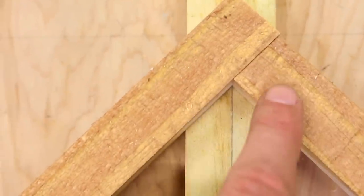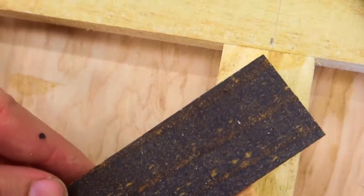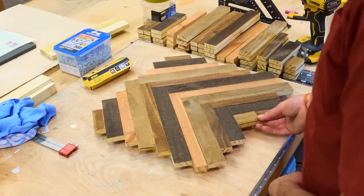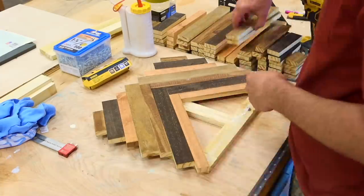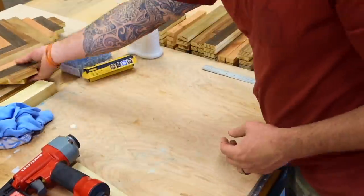From this point, we'll work our way up the part list. Since we started with G, this is going to be F — line it up the exact same way. This is what creates the herringbone pattern that runs down the center. We'll keep working our way up until we get to part A, and for the bottom we'll work our way down — next is going to be H. Once everything is in place — wait, we forgot the glue. You really need to glue this. This is exterior wood glue, so take all of that stuff back off, put exterior wood glue on, and redo it. After you fix that mistake, just use one inch brad nails and go all the way around the entire frame, connecting all of our parts to the frame. Then we'll just repeat this process three more times.